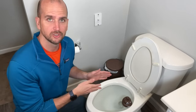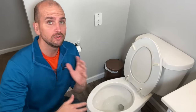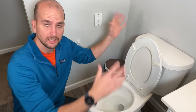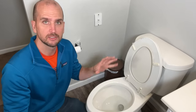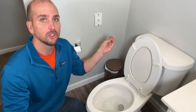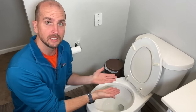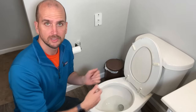If you don't have a plunger, at the end I'll show you a simple hack that might get it unclogged with just a few products you'll have around the house. The second thing to note is you have kind of a two-phase attack here. The initial volume from your tank — about 1.6 gallons — is going to flush into the bowl, and if there's a clog that's going to start filling it up. Then in the second phase, when the tank starts to fill up again, you are also putting water into the bowl, which is why the level keeps rising.